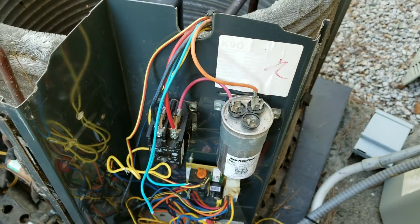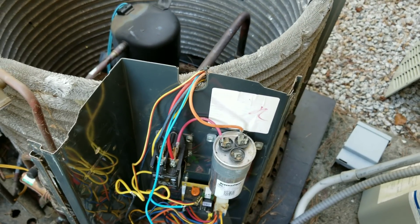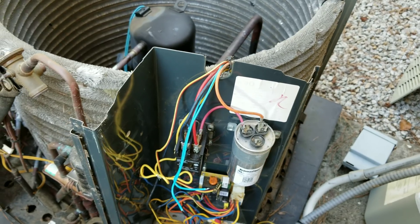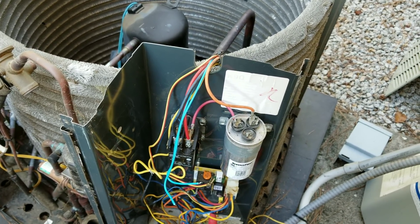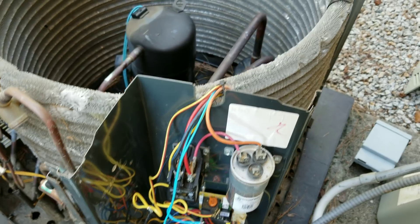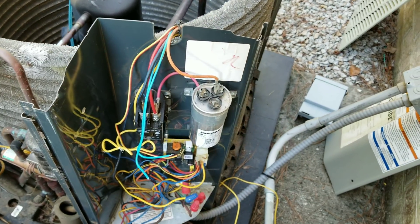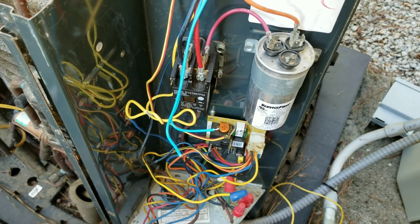I was always maintaining my power out of the defrost board, so that cancels out everything past that. We were looking for something through these switches or the contactor. The contactor coil ohmed out good at about 13 ohms, nothing to ground. Each switch ohmed out good — less than one ohm, all of them about 0.2 to 0.3 ohms. When I started ohming each one to ground, I wasn't getting anything significant except on the low pressure switch — I was getting a very low resistance to ground, about 12 to 13 megaohms.